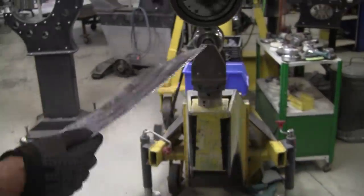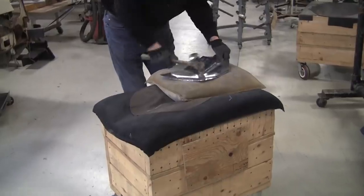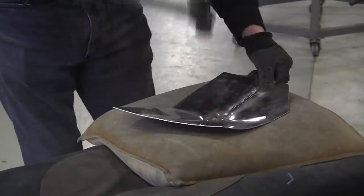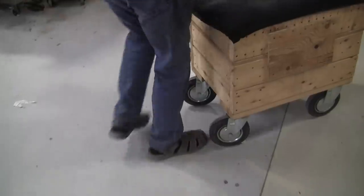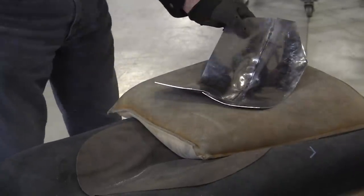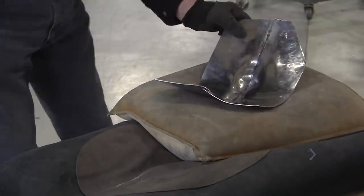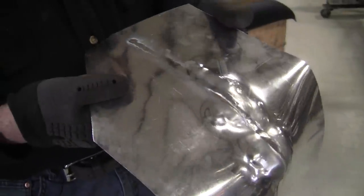The surface has a little bit of undercut over here, but not bad — altogether pretty nice. Now we'll do the torture test with the ball peen hammer. We have an old beat-up ball peen hammer and a beat bag, and we'll start hitting right on the weld. It fatigue-cracked on the side of the weld — not on the weld itself, on the side of the weld. So effectively, the weld zone is as strong as the parent metal.